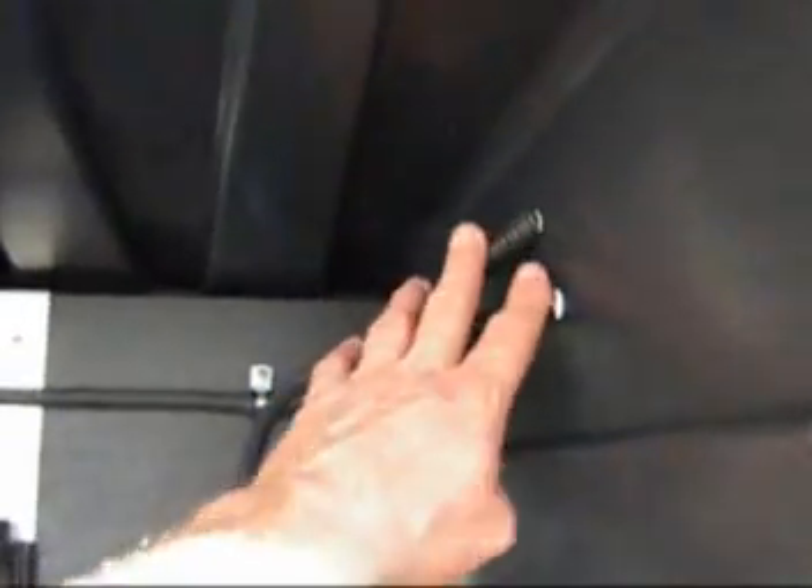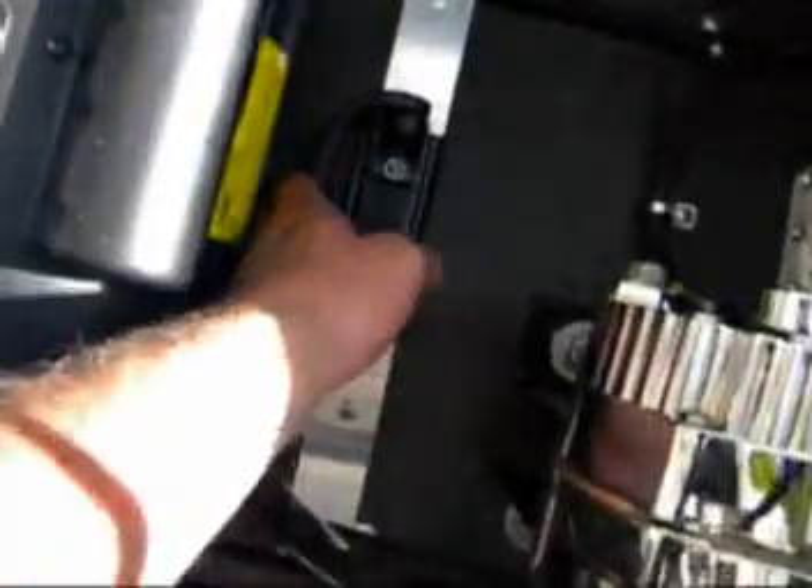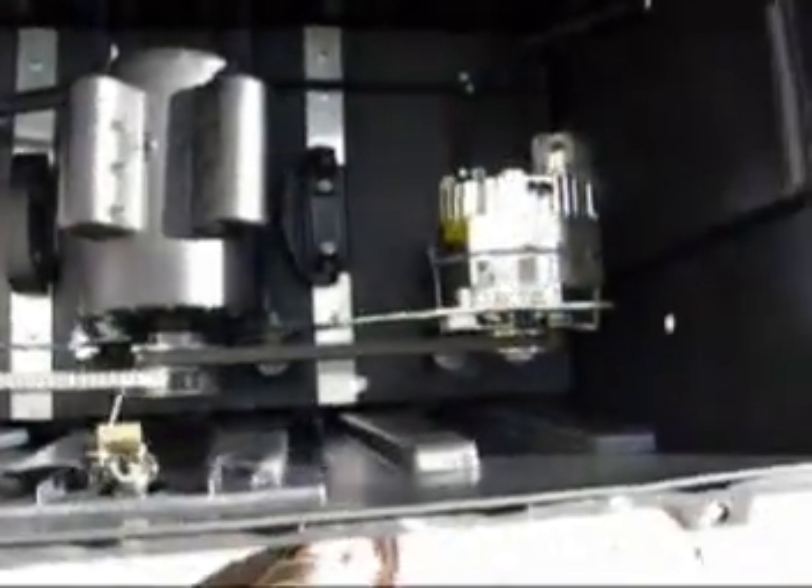It consists of dual alternators. You have an electric motor that drives both alternators, and you have two power lines — one coming off this alternator and one coming off this alternator — and they go out to your bank of batteries. It also has handles in here; basically, if you have to do repairs of that nature, you would unclip it, disconnect, and pull the whole housing out to work on it. It has adjustments on the belts, just like you would in your car.